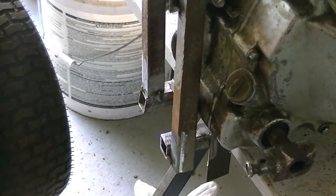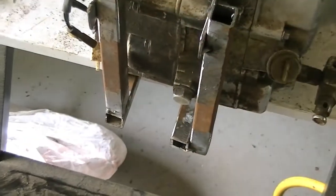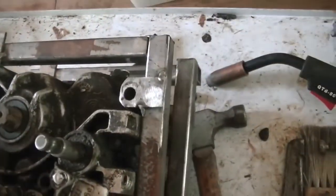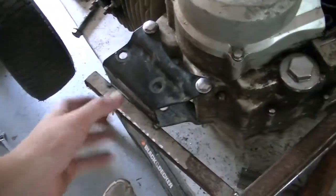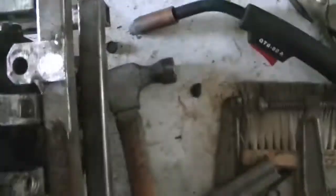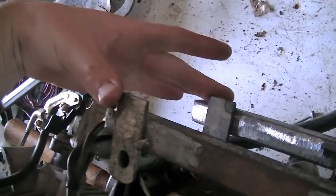I had to clean the garage. There's a drain plug right there — I had to work around it and put that bar off to the side rather than on top. But once I smooth this guy out, I can put a piece across here. I also had to undo these welds and drill holes because I couldn't actually get this bracket to pull off when it was welded on — it would snag. So I had to drill holes and I'm going to put bolts in there instead to attach that bracket. I ground those off. Right now I'm going to add a piece going across this direction to keep those the same width apart and add some solidity. I'll do the same up here — grind these off and do another sideways piece across up there.